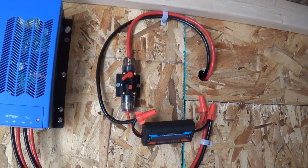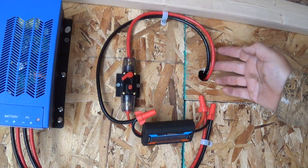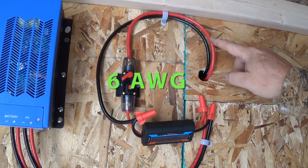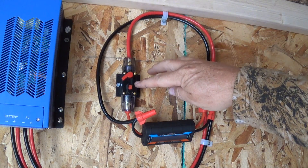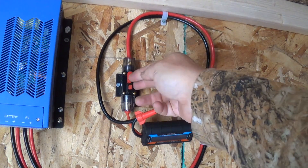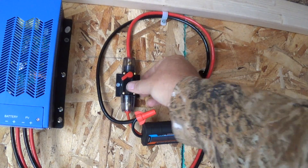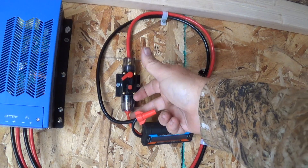Here's what I've done: coming in right here through the wall, these wires go out to my solar panels — positive and negative — using six gauge wire. The wire comes in and goes into this breaker here. This is an inline breaker — more of a breaker than a fuse. Set it this way and it's live. Press the button to turn it off, or if it trips, it's going to look like that.